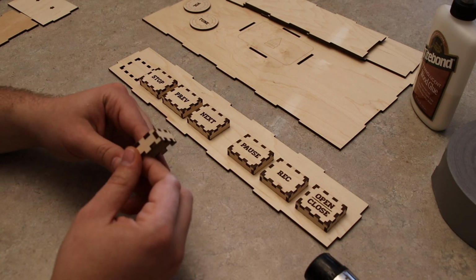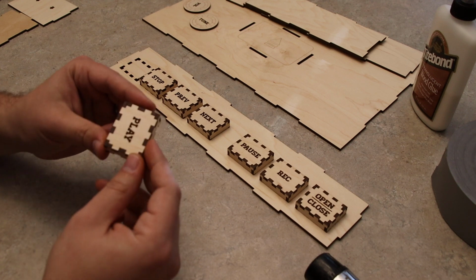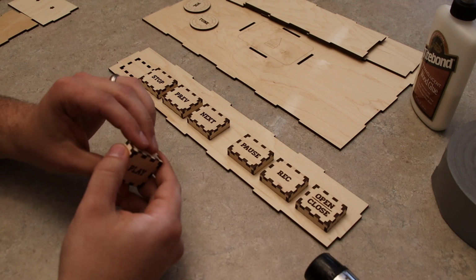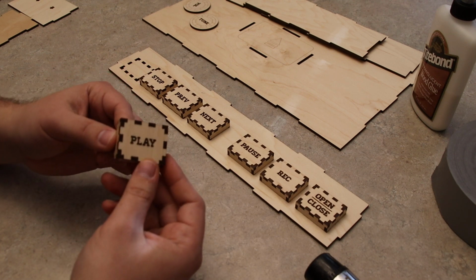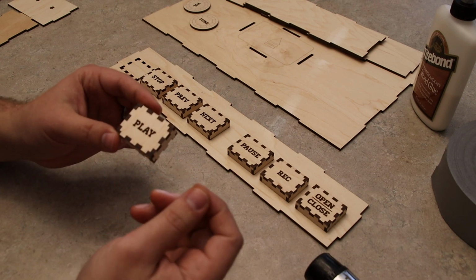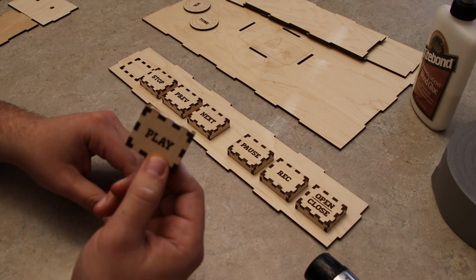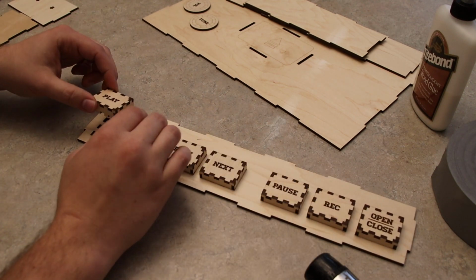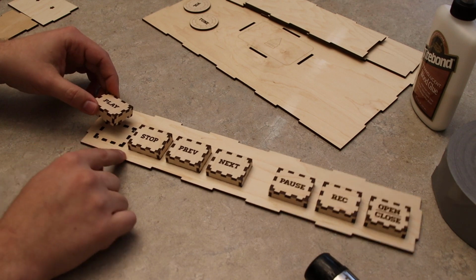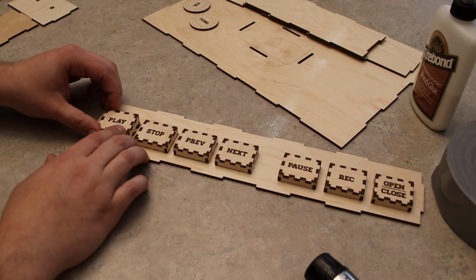These are delicate parts. These are very thin grooves and thin edges here, so just a heads up on that. You want to be careful, and you want to let the weight of the hammer do the tapping for you. If you have to, you can apply a little force to the hammer, but don't do it very hard. Obviously, you don't want to smash that and crack it. Same thing applies here. You want to ensure that this is flat on the table before you pound this in.